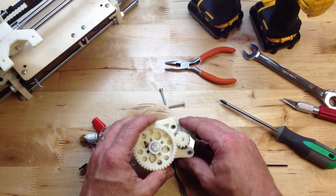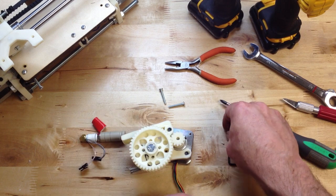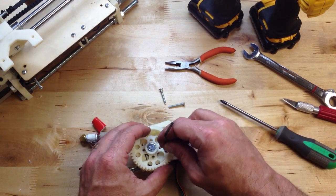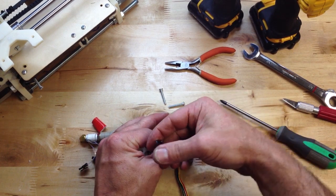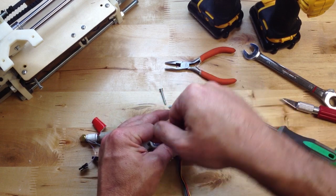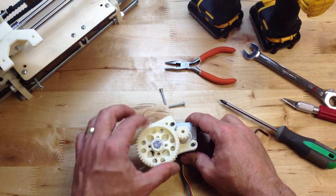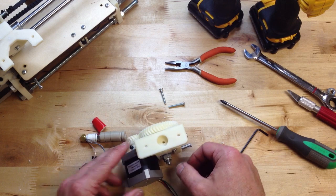So the third one — if you rotate this around, you can see the last hole. Once you have it positioned where you like, you don't want to try to position it with three screws. Position it with two, then put the last one in. Now it's good and tight, it's not going anywhere. We're almost done — all we need now is the hot end.